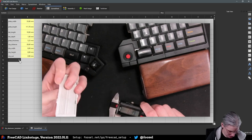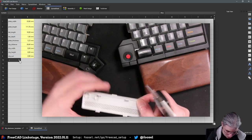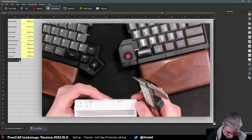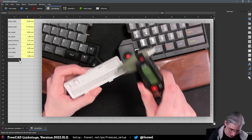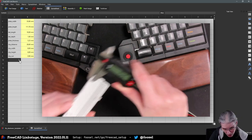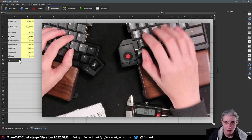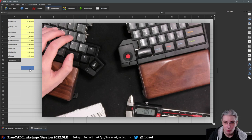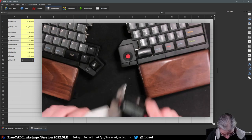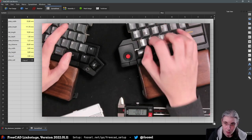And I think we also need the strength here, right? Oh, we also need the wall strength here, because there are things inside. We need to clear these, so we cannot just make it what we want it to be, but have to stick to 1.9 millimeters. Plate, wall. Ah, it was that way. Thank you, Granders. What did I just measure? 1.9. 1.9 millimeters.